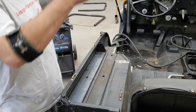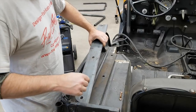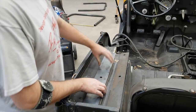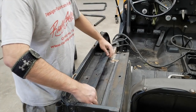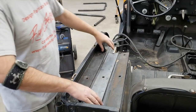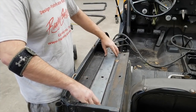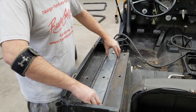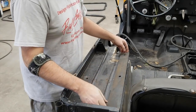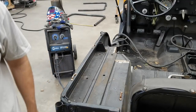I was getting ready to put the rear hoops in and this is the plate that they sent — it didn't quite fit in this corner so I radiused it. Turns out it doesn't go there; it needs to fit on the inner one to line up with the front hoop. Also, once both sides are welded in you couldn't get it out because of a lip. So I ended up remaking them — sketched up another one, made it slightly narrower, had it plasma cut, and that one fits down in the channel like it should.